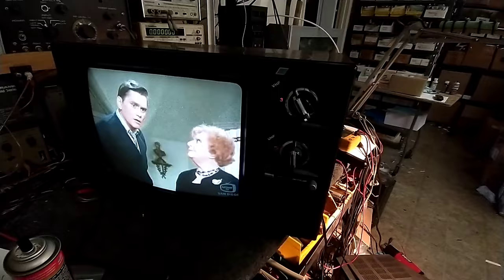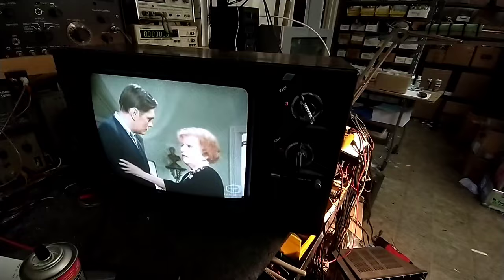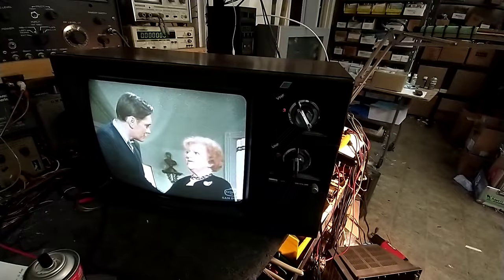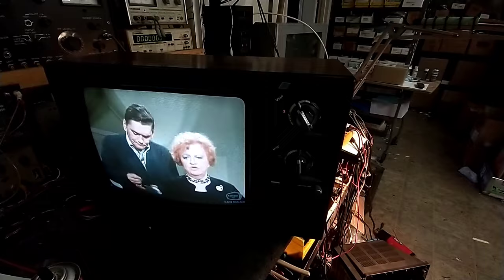Didn't get a chance to find my tuner subber, so I just went inside the tuner, did some quick troubleshooting, found the oscillator transistor, which is usually adjacent to all the coils. In case you're curious, this was a 2SC1730. It wasn't getting proper voltages, and if I jiggled the contacts on the tuner, it would kind of sort of come back, so I just used an aggressive cleaner like D100 and just cleaned all the contacts, and then it kind of came back to life.